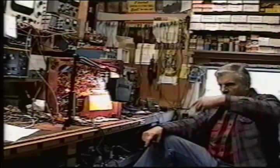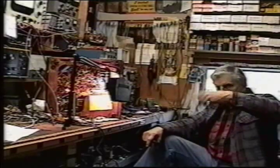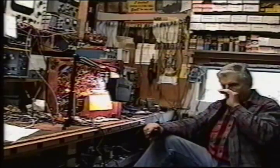You probably remember when you were a kid, you used to sit there and watch a television, it would start rolling and you'd get up and adjust it. You'd get comfortable and it would start rolling again. Parts change value. On tube sets they heat up, and the heating and contraction of the vacuum tubes, the components, the capacitors, and so forth — they're all affected by temperature, age, moisture, and so on.